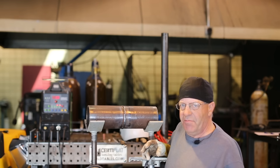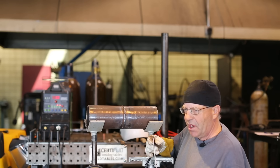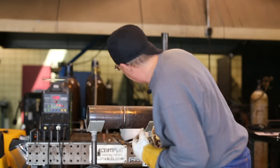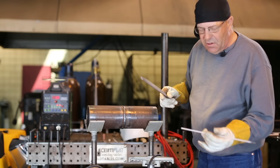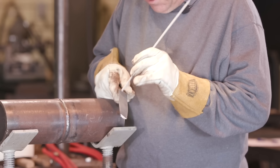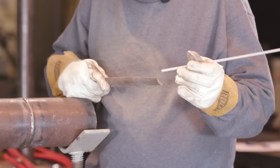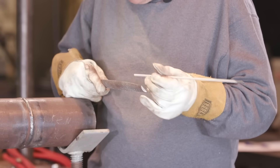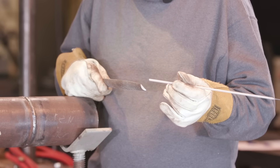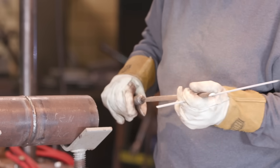The whole demonstration is how do you get comfortable and come off the bottom? I'm one to use half-burnt rods when I come off the bottom because they're shorter and I can be more accurate. The trick to running these is I'll take one that's half-burnt and scratch it on a file or tap it so that it's clean, but it still has the flux around the end of the rod. Nothing worse than one that's broken off with about a quarter inch of wire and no flux — that's going to make for a hard start and probably some porosity.